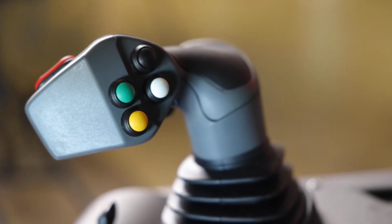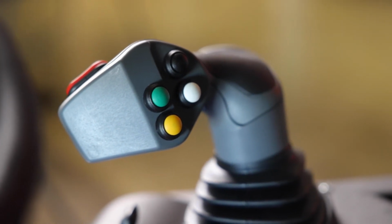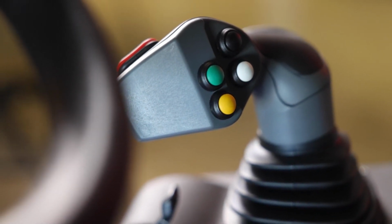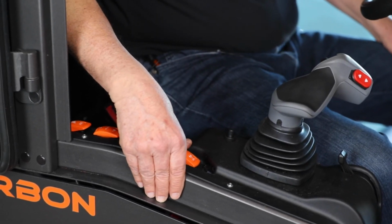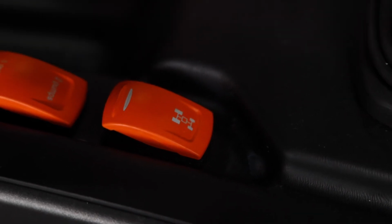2 buttons on the inside run your telescopic boom. As the boom naturally is up in the air, you're reaching forward, you're pushing 1 button to get that boom to go out intermittently as you want it to, or full extension, or bringing it back in with the reverse button. Down below, we've got an anti-slip control. Hold the button in when there's real need, real slippery conditions, maybe in snow or greasy mud conditions. You have full locked-in 4-wheel drive with all 4 wheels as needed for that work.